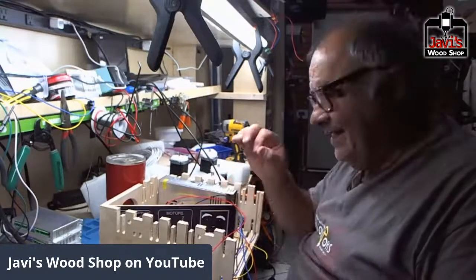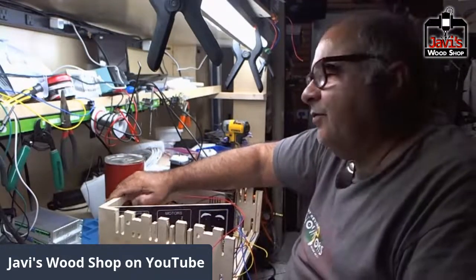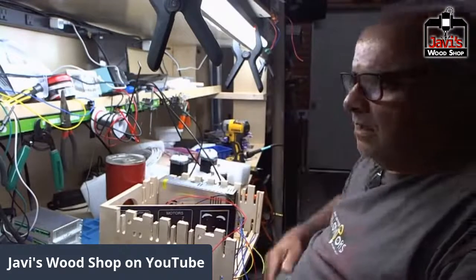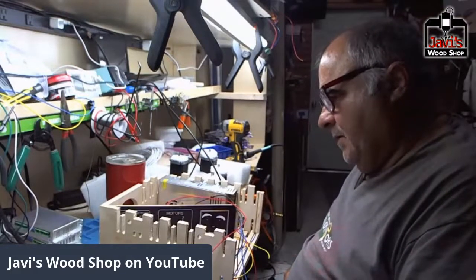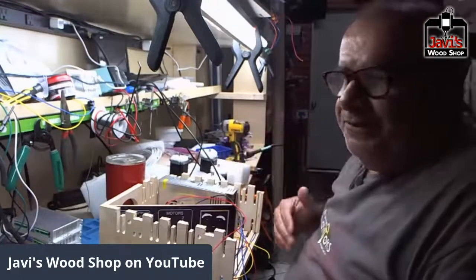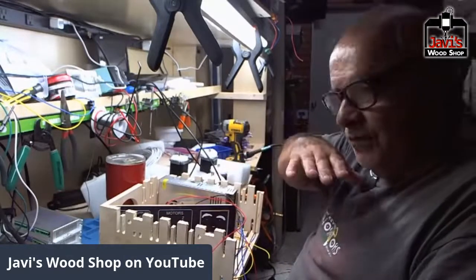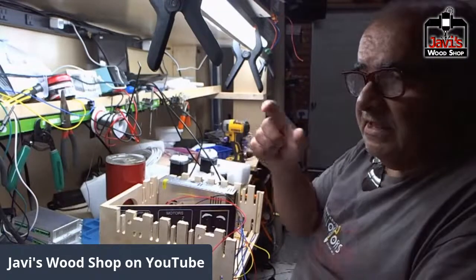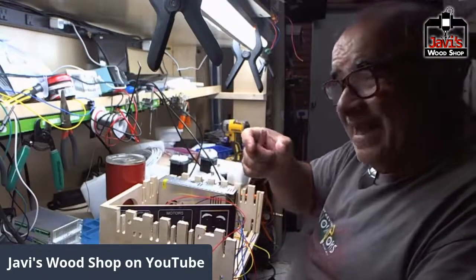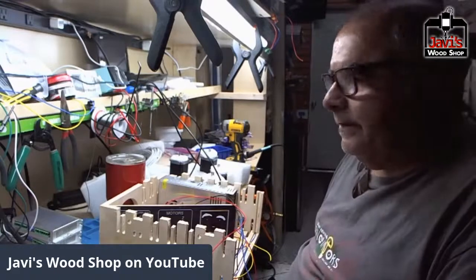Now, if it's almost identical everywhere, well, actually, you could pretty much tell if you've surfaced your spoil board and you've used anywhere between 40% to 75% pass, because if you do a 1% pass, you're not going to see any variations in your surfacing. But if you use a nice big pass and a big bit, like for instance, I have a 1.5 inch surfacing bit. If I go 90%, if that thing's not trammed, you're going to feel the ridges.